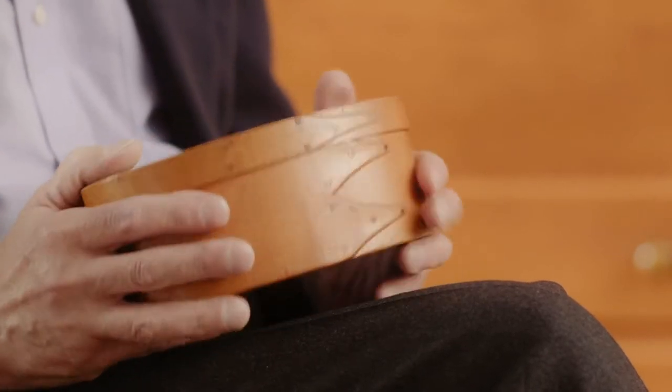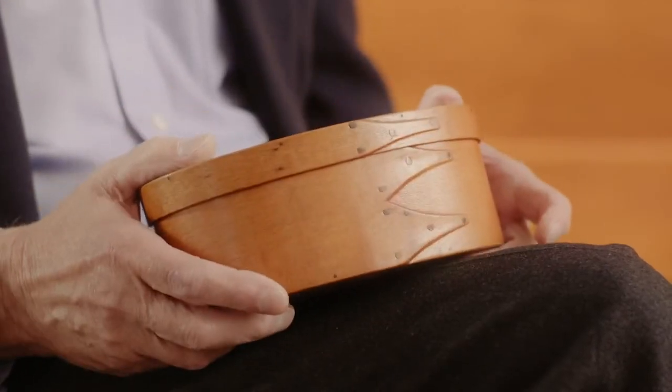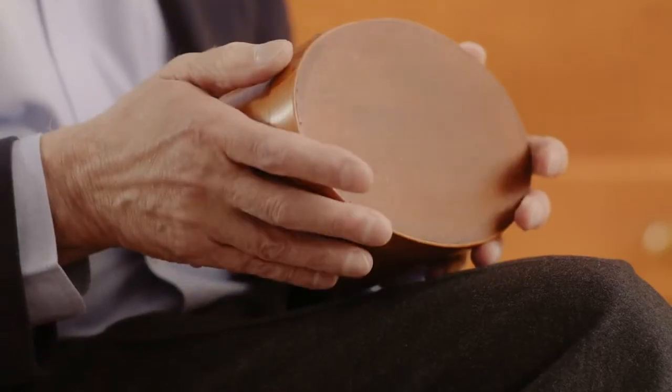The bodies of the boxes — the rims — were thin flat pieces of planed maple. These pieces were cut to size on templates that allowed for the overlapping swallowtails and the placements of the copper rivets that would secure them together. Once these were cut to size, the bodies were immersed in hot water or were subjected to steam in order to make them pliable. Then they were rapidly wrapped around a form and secured by the addition of the copper rivets. The top and bottom boards of the boxes were called the heading. The heading was cut after the forms were dry and secured by copper points or brads along the rim. Made this way, the boxes prevented deterioration of contents or accessibility to insects.